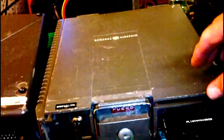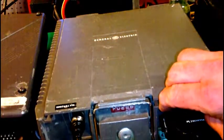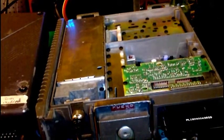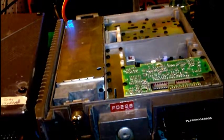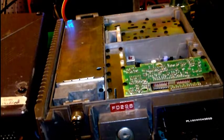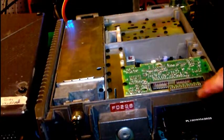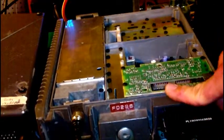I'll get a quick look inside. The Delta has a cover that pulls off like that — it can be locked, there's a key here, and luckily it's unlocked. The outer case is all made of aluminum. You've got this board that's upside down here, like a daughter board plugged into the motherboard below. It's the PL tone — they call it channel guard — and the GE encoder and decoder board is up here.